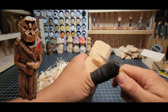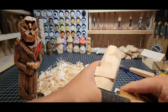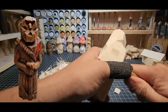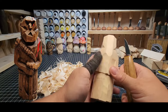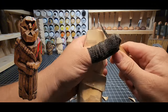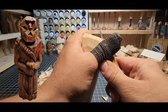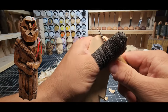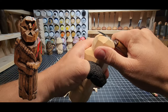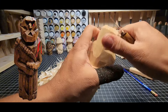Finding a bit more underneath that right arm and taking a little bit of that away, and we're just going to keep doing this — deepening some of these lines, especially along the bottom of the arms, getting more of this out of there. We want to make that base nice and round, keeping it about the same distance around. Let's work on the top of the head — rounding off that top of the forehead and the back of the head, and starting to clean up those rough saw marks on the top. Be careful — you want to round the head but not too much too soon.